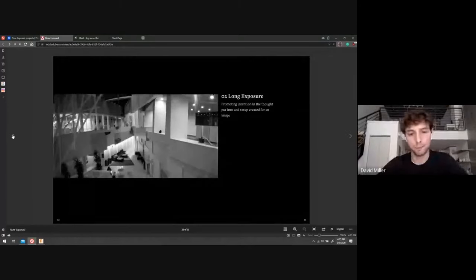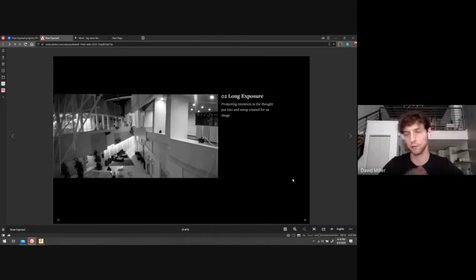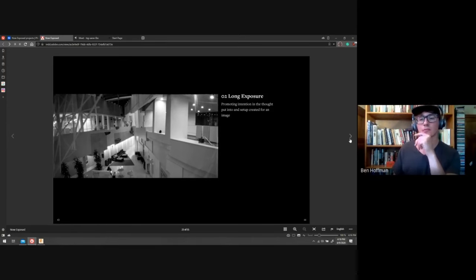He pulled that up just to explain the process that ended up being: we took long exposure photos, depending on the light conditions, since we didn't have any way to extend exposure times beyond what the exposure needed. This is everywhere from a 2 minute exposure indoors to 10 to 20 seconds outdoors. For the final design of this camera, we included an ND filter mount in the front, a little screw mount, so you could add ND filters.